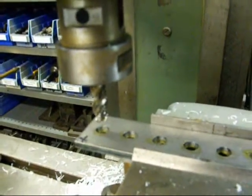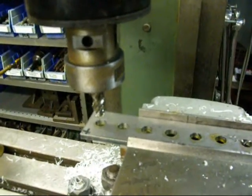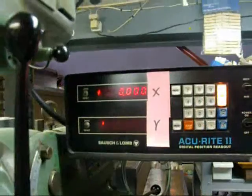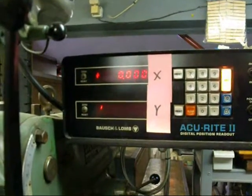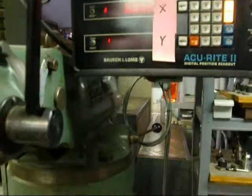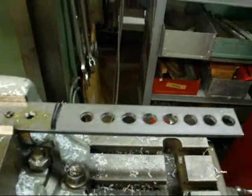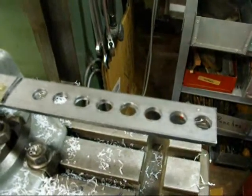I'm going to use plenty of oil and we'll tap about six holes there in rapid succession as I move it down. Those holes are spaced exactly an inch apart, so I'm going to move the table until the digital readout moves an extra inch each one. If we've got time we'll also tap some of these large holes here, which will be with a three-quarter tap.